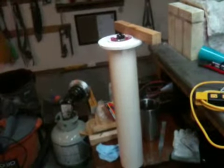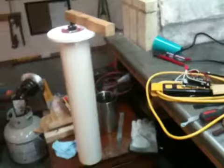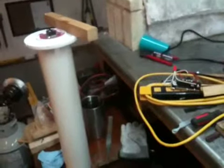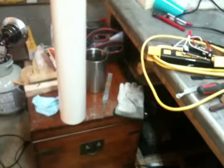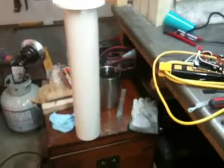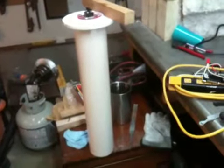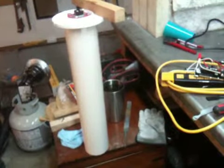I really don't think I'll be able to do that very easily with these supplies or this current setup. I think I'd have to make some pretty large modifications — such as drilling a hole somewhere in the middle to the top of the tank and installing a copper or aluminum plug as a heat sink to gauge temperature on the outside using that thermostat. Another option would be getting an electronic thermostat that uses a thermocouple, draping it over the top to monitor the temperature. I'd still need to circulate the quenchant somehow, by hand or with a small pump. I really don't want to invest that much effort or cost for this particular project.